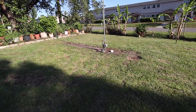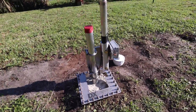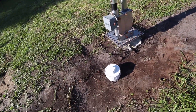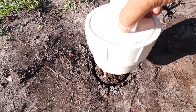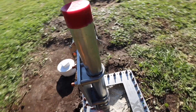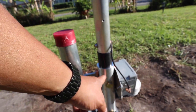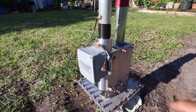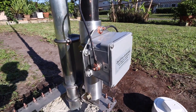I have not put down the radials yet - that's the next step: 37 radials. Here's the access for my ground. The ground braid goes under the base and comes up to this mounting bolt, which is the negative side. And here is the positive terminal for the radiating element.